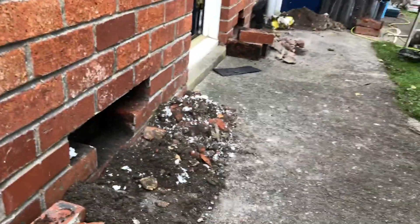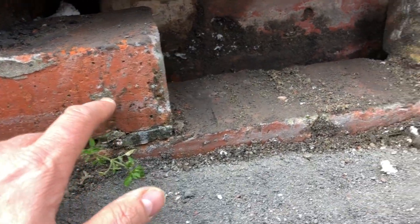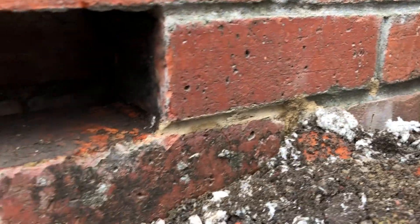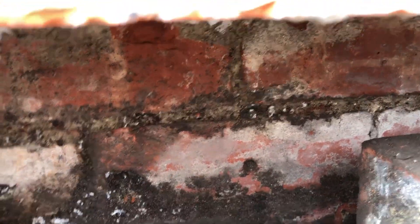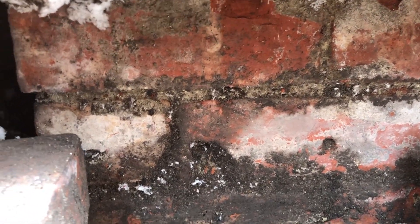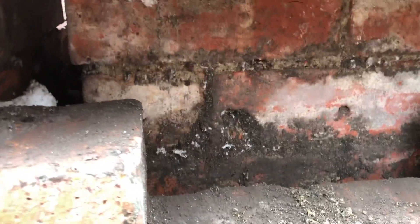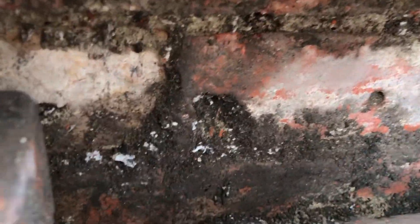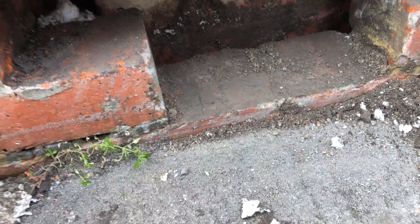Some of the dampers down there were drilled through the damp proof course. This has been drilled through the bricks, as you can see here. They've also drilled it through the damp proof course there. But if you look here, when they drilled the inner skin they've actually drilled all the way through, and haven't actually pumped anything into the cavity - an absolute complete waste of time. These bricks are literally soaking wet.